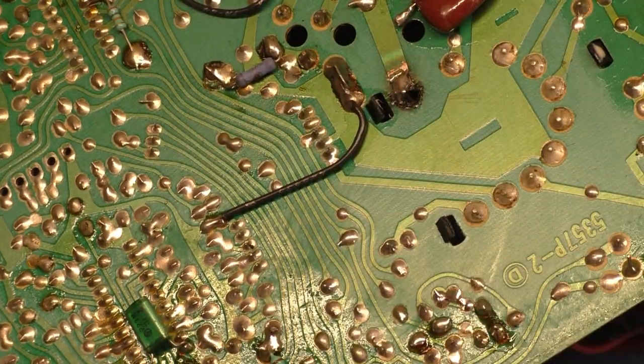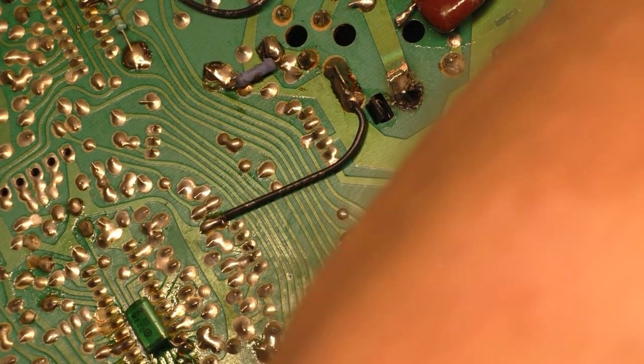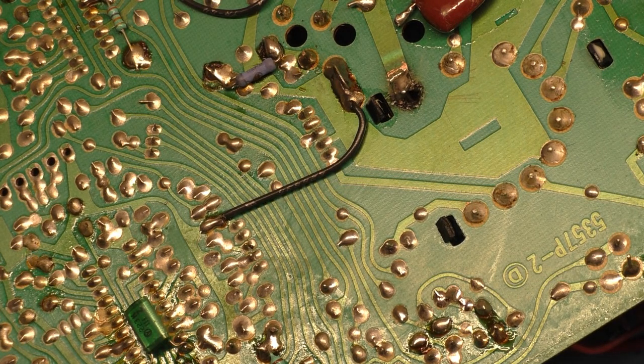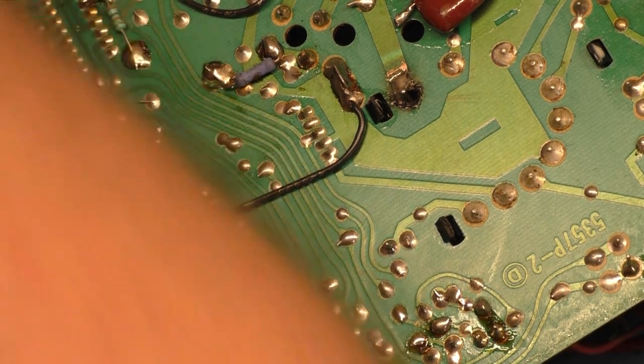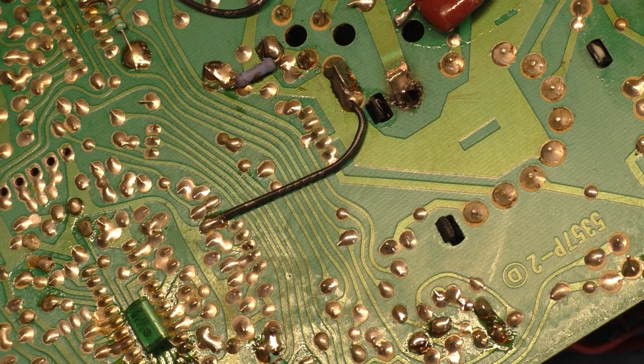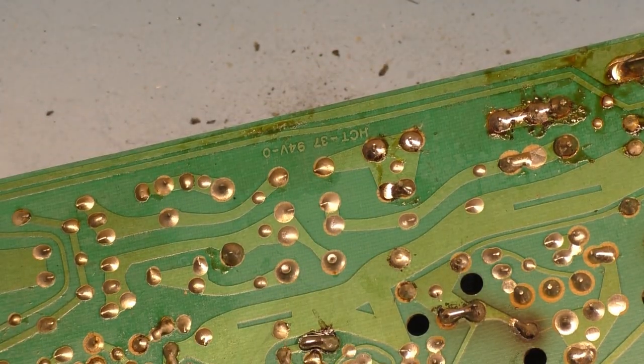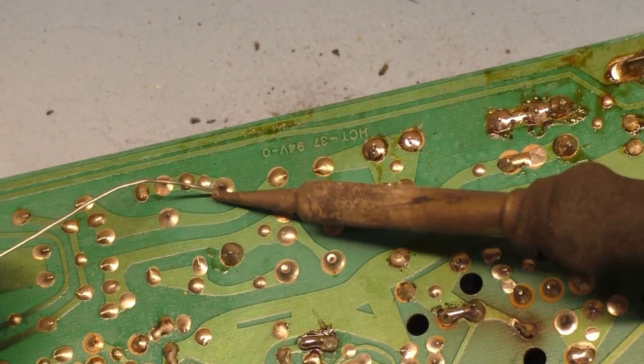All right. We'll get our C38 installed and that'll be about it. It'll be time to test it now. Unfortunately, I don't have the correct tube with me, or the correct setup, I should say. However, you can run a medium res 7000 on a standard res 7000 yoke for testing. You don't want to run it for half an hour straight or any length of time. But for just a quick test to see if it functions, you can turn it on, check it, make sure it works, and then that's all you want to do. But it will work. I've already done that testing and verified, so...